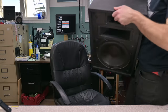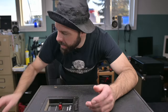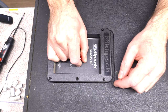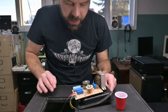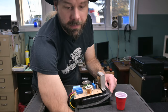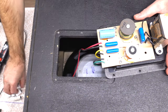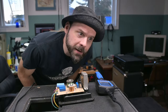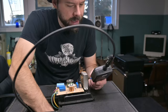Let's tear into these things and see what we've got. This is the first one with the damaged woofer. Going into the back should reveal what we're looking for. We've got some beefy wires in here with color codes. I'd rather not have to take the speakers out, so I'm setting up the snake cam to get a look inside. I can see the capacitors in question — that's definitely an old guard there, marked 1.5J250.